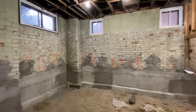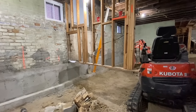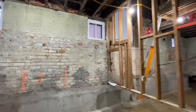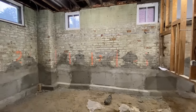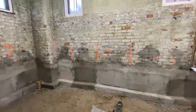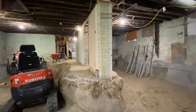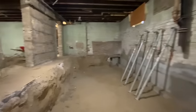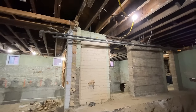The darker sections were poured last and are still curing a little bit. This wall here is a good indicator of where the floor height used to be and what we've gained. That wall is suspended in midair — not picking up any structure, otherwise we wouldn't have removed what's underneath it. You really get an indication of how high the windows are going to be. We're coming up a foot from where I'm standing — six inches of gravel, two inches of insulation, and four inches of concrete — ending up with about nine foot ceilings. The center section can't be removed yet because it's load bearing, but once we put in temporary support posts we can remove the center section including this brick wall, put our strip footing down the middle, and restructure the framing to open up this entire space.